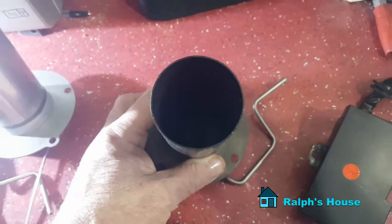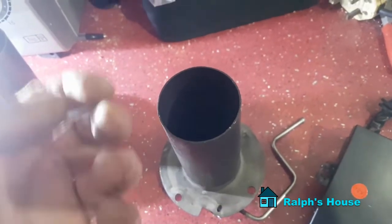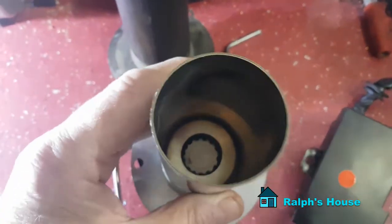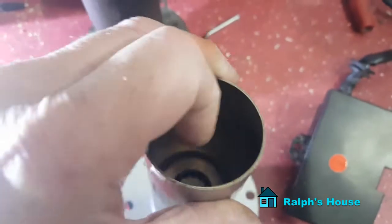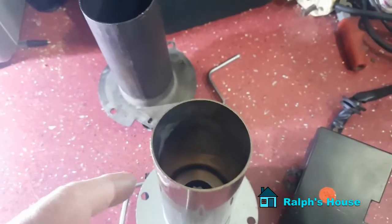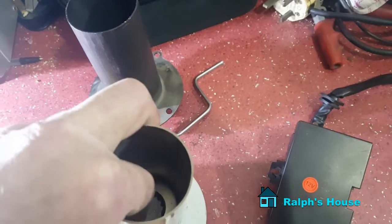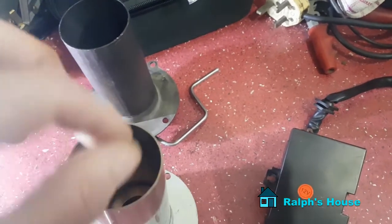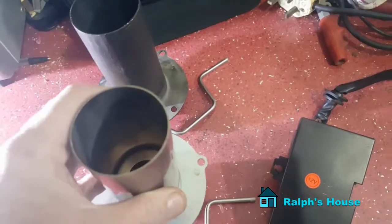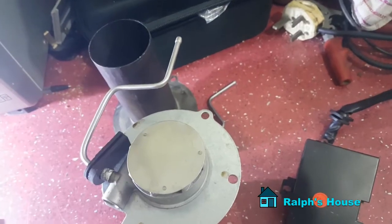So if you're getting that and you're very frustrated, on the point of throwing it in the bin — order another burn chamber. Chances are it's carboned up. It's not sufficient just to clean the combustion chamber and the burn tube; you've got to get right down there in the bottom. This one's quite good because the ring is slightly higher so it's easier to get a wire in. The little tool I showed you works really well — a small right angle on it, go around and mash it and eventually you'll get it all out. When you can't feel any carbon on the end of the steel, put in a new gauze, put the burn chamber back in, always new gaskets, put the whole thing together, start it up and it'll run.